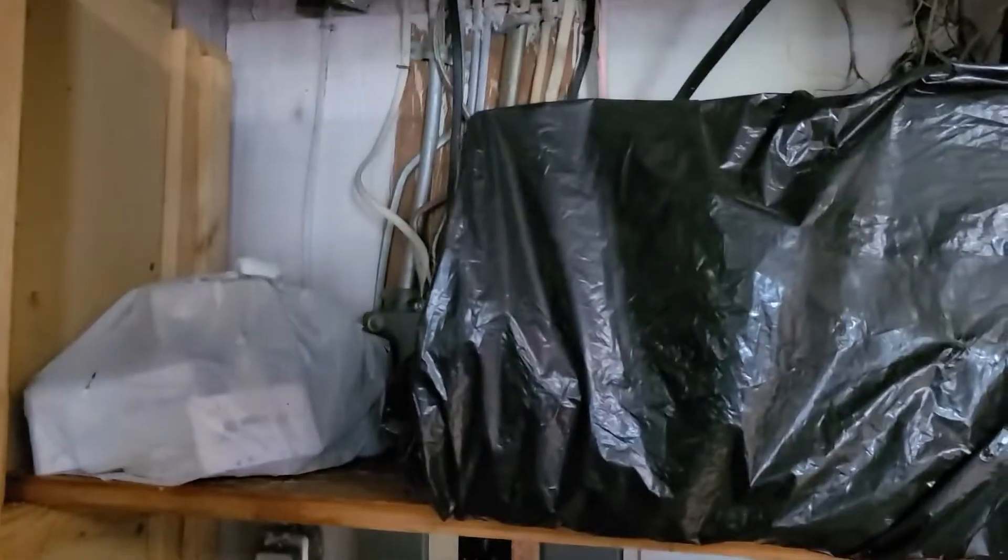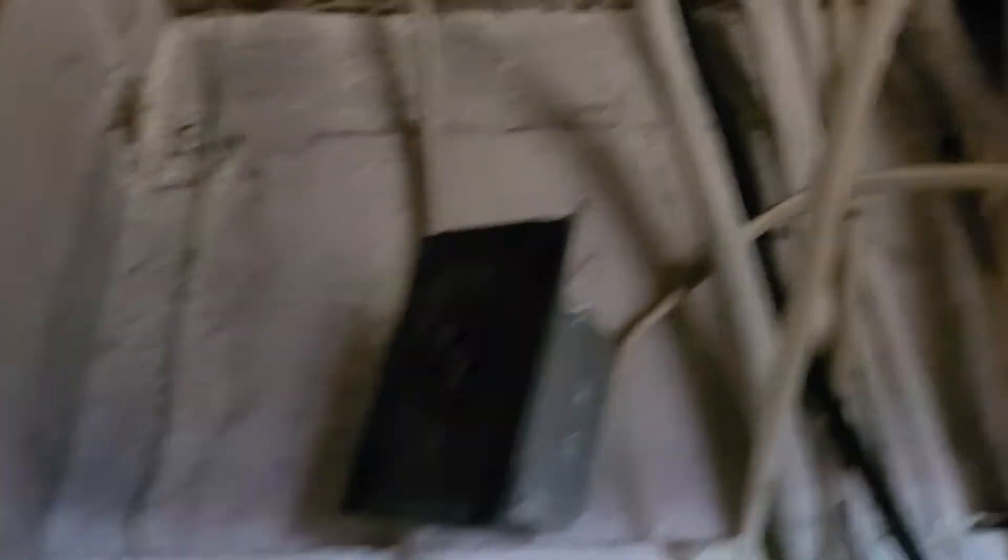Here's the panel. I've got a few things I need to remove out of my way. One thing that was noticed was this guy right here — I put a meter on there and that thing is live. I don't know why it's up there. So we're going to disconnect this plug, find out which breaker it belongs to, and then we're going to run a new wire outside.